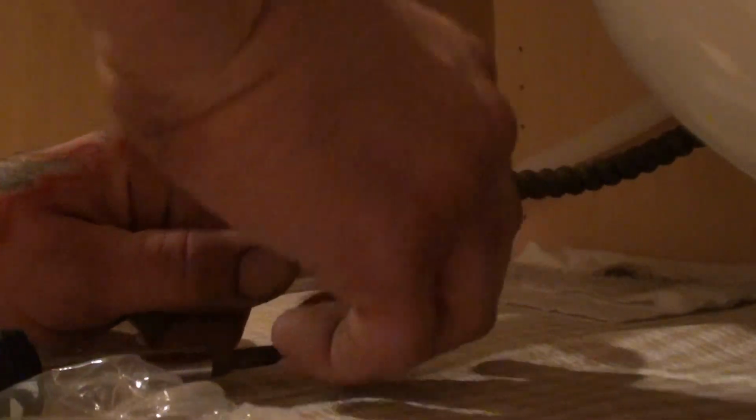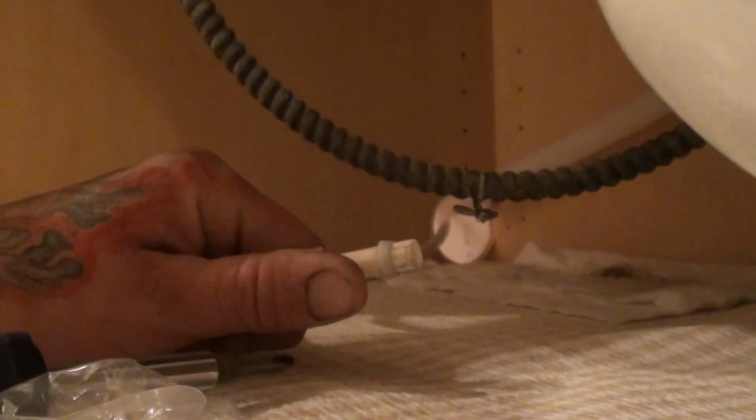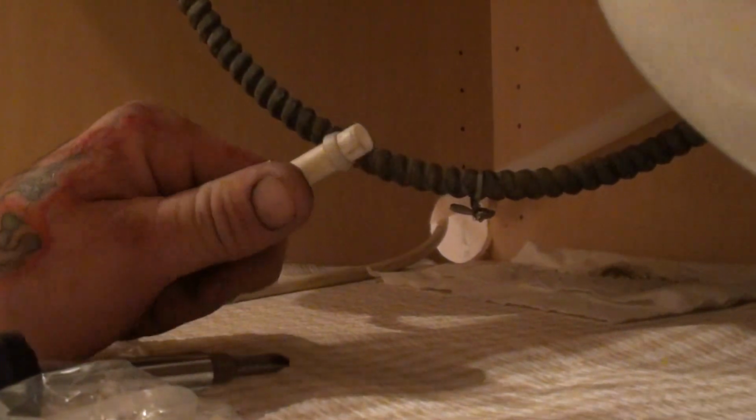Oh, the ferrule slipped out. It needs to be about to there. All those fails if you don't get it on far enough or too close. You could barely put it on and then push your water line up into your valve. It'll stop when it needs to. So there's our valve. Take that, push up. Oh, it went up a little bit further. And then start putting it on, and then your water line's going to be almost complete.